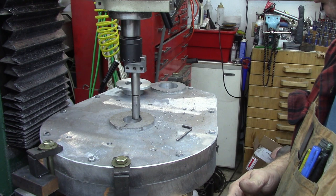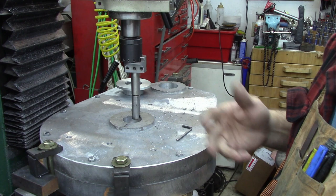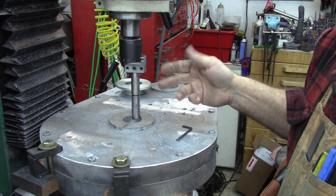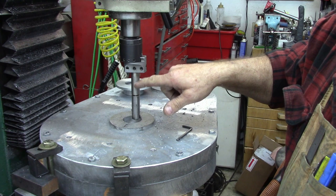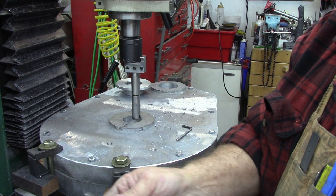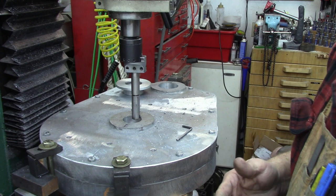It's a good way to use basically junk tooling. I'm probably going to build a couple more lengths of this in different sizes and just use this head. Once I finish this project, I'll clean up the gnarled end where someone had pliers on it, and machine a couple of flats on the side so we can grab it with a wrench - probably the same on the upper portions of the bar. It's an Armstrong bar, fairly decent quality, old and beat up, but now I'm able to utilize it - one more piece of tooling.